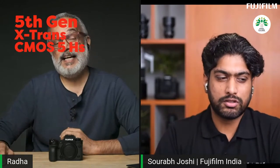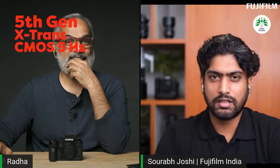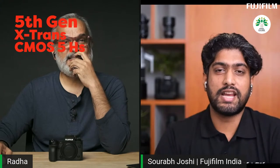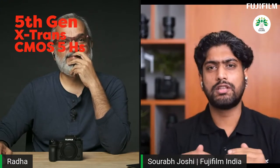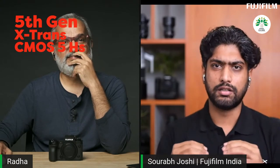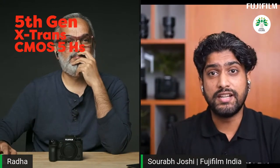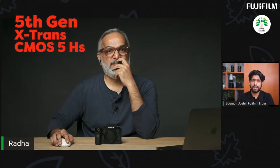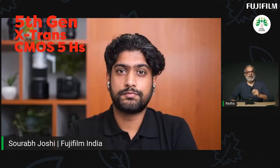Correct. Talking about the sensor here, it's the newly developed fifth generation CMOS sensor, and it is the HS, the high speed sensor. It is a stacked, back-illuminated sensor, also stacked with copper wiring and circuit, which reads out 4 times faster compared to the fourth generation sensor that is there in the X-T4. Oh, that's fantastic.